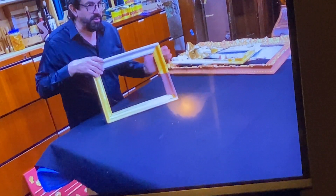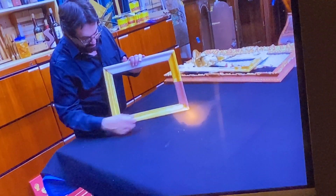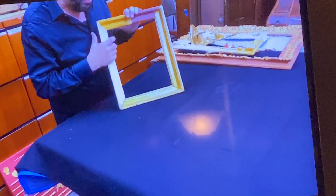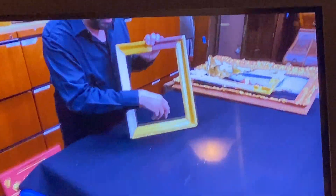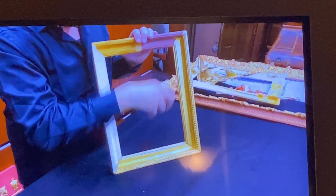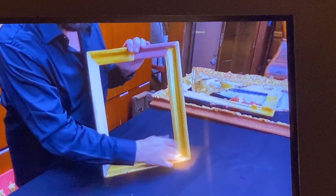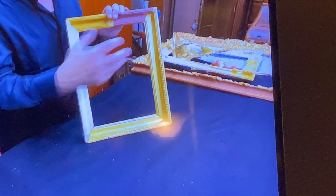In the same token, the gold was laid on the first half and the base patina with gelatin is put on the second half. Then the patina is laid using various paint pigments and smoke. Remember, when this frame was up against the wall, a lot of the major patination was occurring on the bottom part — environmental effects landing year after year. Even somebody cleaning the frame would track more dirt or move it around to that area. So you would always find much more dirt on the bottom. We're going to pick up with recutting in just a moment.